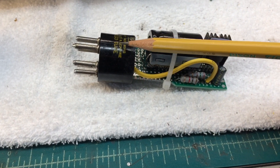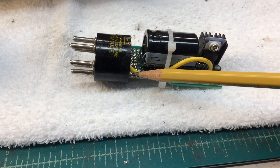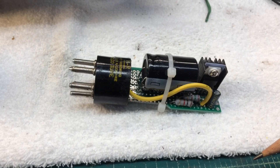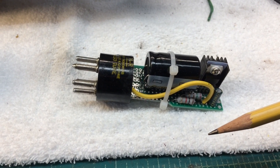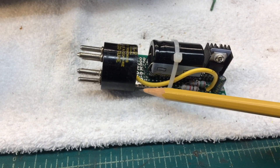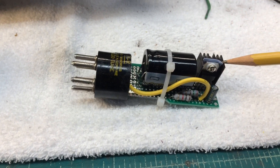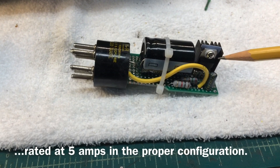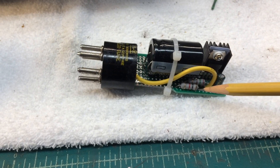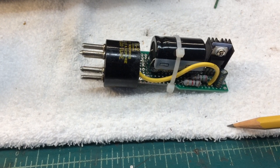Here's where I'm at right now. I had an old discarded tube — broke the glass off, salvaged the base, small chip here, a little epoxy. It's a six-pin base that will fit into the synchronous vibrator socket. I cut a circuit board to wedge it in and fit my input filter and voltage regulator on it — the LM338 adjustable. I have it in a fixed position using a 250-ohm and 1,000-ohm resistor to get close to hopefully six volts out when everything is said and done.